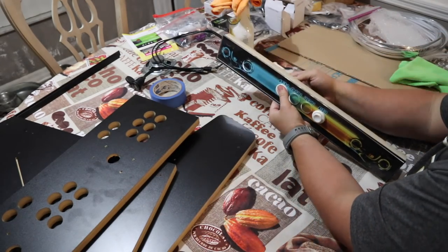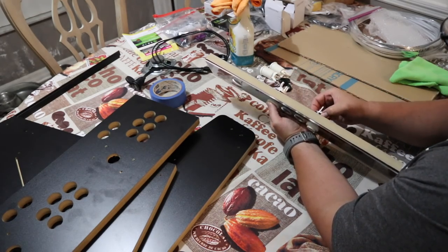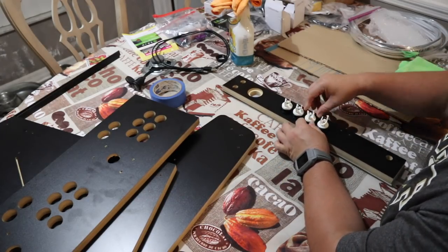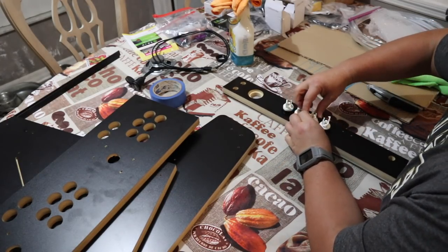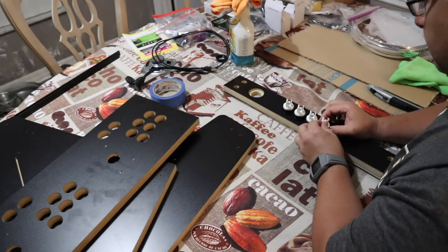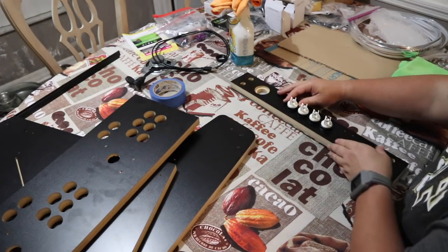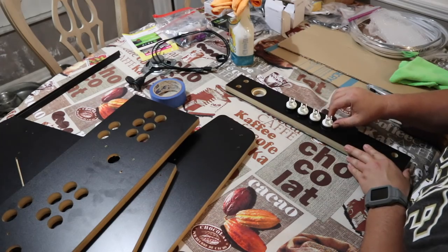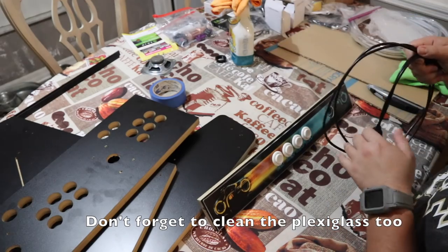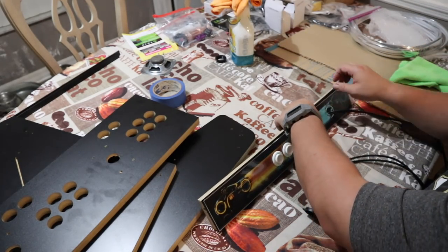And then after this, you just rinse and repeat once you feel that you're satisfied with the placement of the plexiglass. Now you're going to want to make sure that you orient all your buttons at an angle. That way, when you do put in the switching mechanism and wiring up, it'll be easier to get to instead of it all being straight. Plus, there's going to be a lot of wiring, as you'll see here in the future of this video, and it's best to have that angle put in a little bit. That way the wires will hide behind the panel a lot easier.